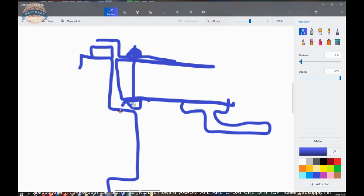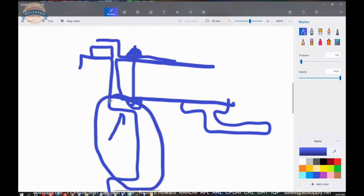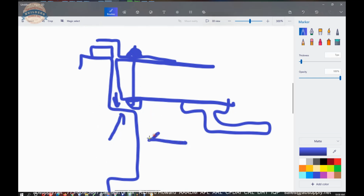Well, the problem is the conflict right here. Depending on where you position the carriage bolt, when you close the door, you might hit the face of the stop. A lot of people say this is the stop, but this is the stop face, this is the soffit. You're going to make unintentional contact, potentially, with an acorn nut and the face of the stop. So how do you mitigate that? Well, obviously you use the EBF fastener.